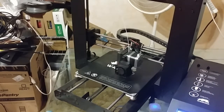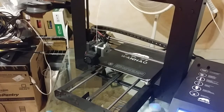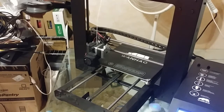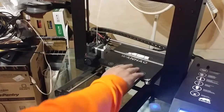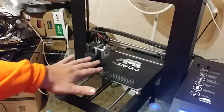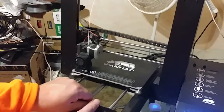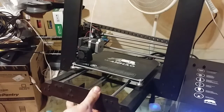Go to home all and let the printer do its thing. Once the printer does its thing, you go to quick settings and disable steppers again. This will allow you to move them around. It's very important that you do not touch the nozzle and don't jostle the printer to make contact with it or you'll defeat the point. The nozzle is significantly above the bed here.